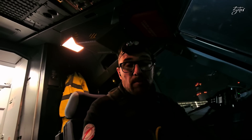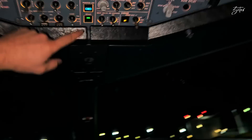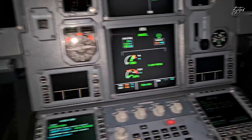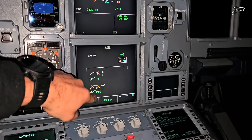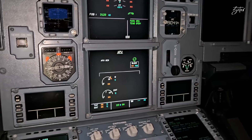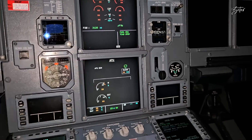I'll go back to check if everything is okay. It looks good, so we can shut down the APU. Of course it takes some time to switch off because we need to pass a cooling procedure, but in one minute the APU will shut down. We can see we have zero percent RPM now from the electronic box itself. Switch off — we have no indications, which means the APU is off. We can go back to take a look.